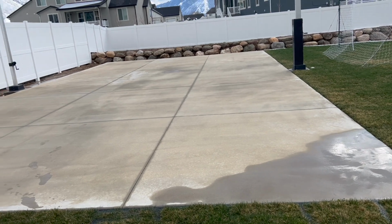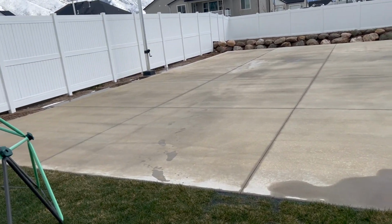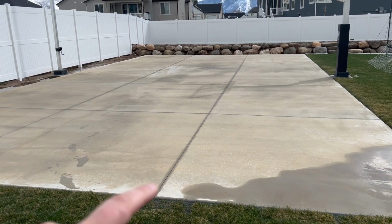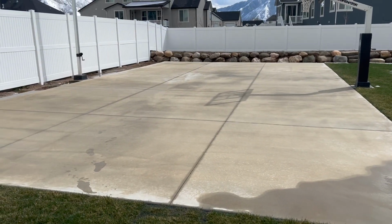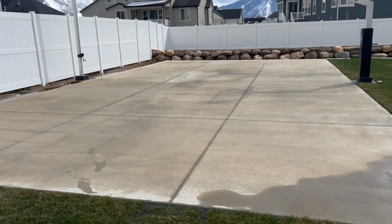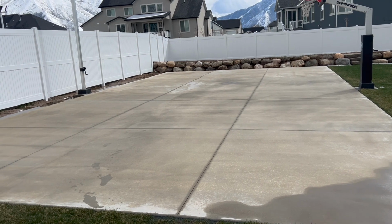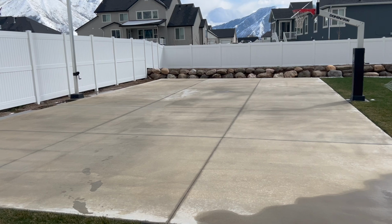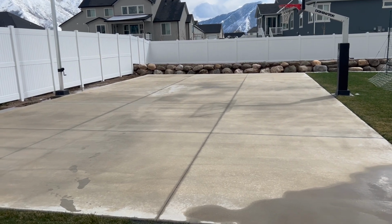This is gonna last forever, basically, without having to do post tension. If you don't know anything about post tension, it's basically where you can see the cut lines. Post tension makes it so you don't have to cut any lines. And the only benefit of that is if you really care about having a little tiny crack when you paint it. But if you don't really care about that, it's not like a big deal.